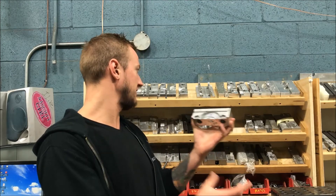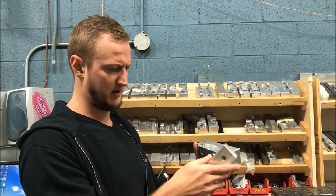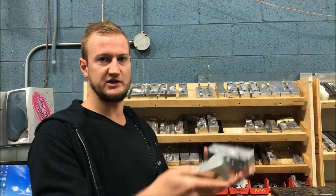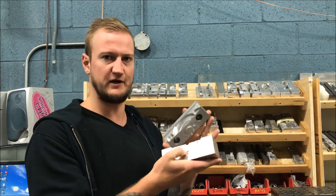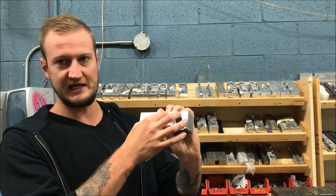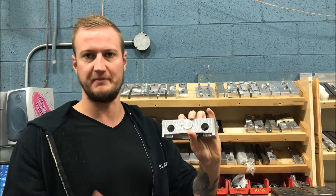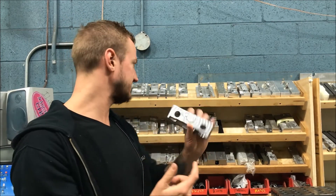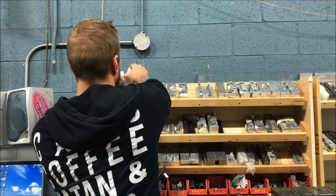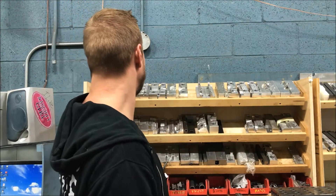These are good for holding round things if I don't want to put a chuck in the vises. You mill these as needed. You can see here I milled a circle in here — these held a round part and they got drilled a bunch. I'll put the part number on there so I can use these again. I can always mill that off and put something else in there. As you can see here, we had a part with a keyway — a bore and a keyway — so I want to make sure that keyway was lined up parallel or perpendicular to what I needed. These parts here are X-shaped, so in order to hold those, we hold them like that. It's just different ways of doing things.